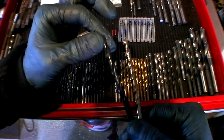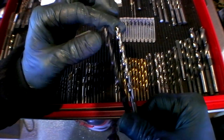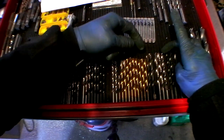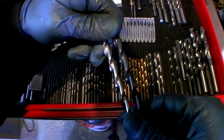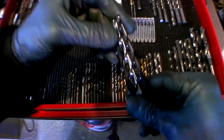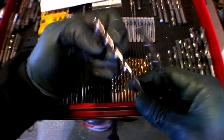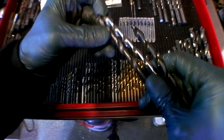The black one's a lot more gradual, and the helix on this one is a lot tighter. Now supposedly these are for aluminum; however, these ones over here I know are for aluminum and they work amazing. They've got a super shallow helix, and the profile — it's like they ground out so much of it that there's hardly any drill bit left, compared to a regular.